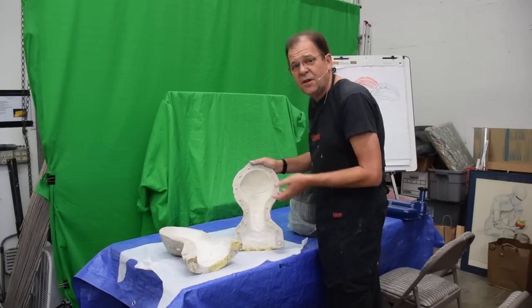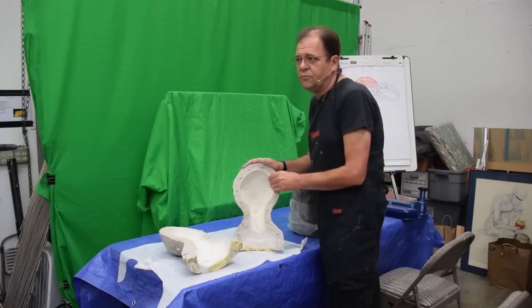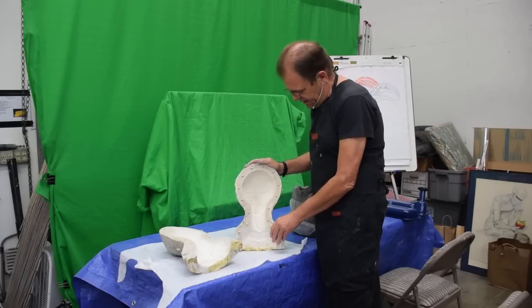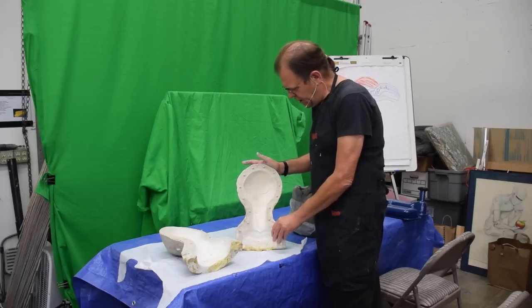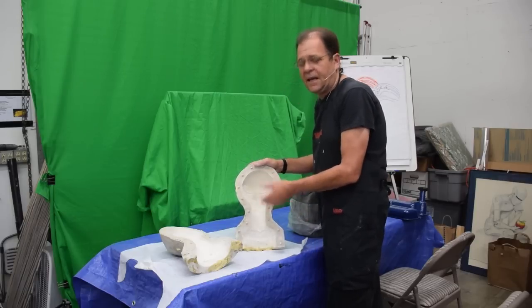And then we're going to make a silicone mold and make these out of two-part polyurethane foam, polyurethane resin, which will last virtually forever. It'll outlive us all. The mold will last a little bit longer too. So from time to time we'll have to do that. I will always keep this mold so I can do that again. I can make another clay press.